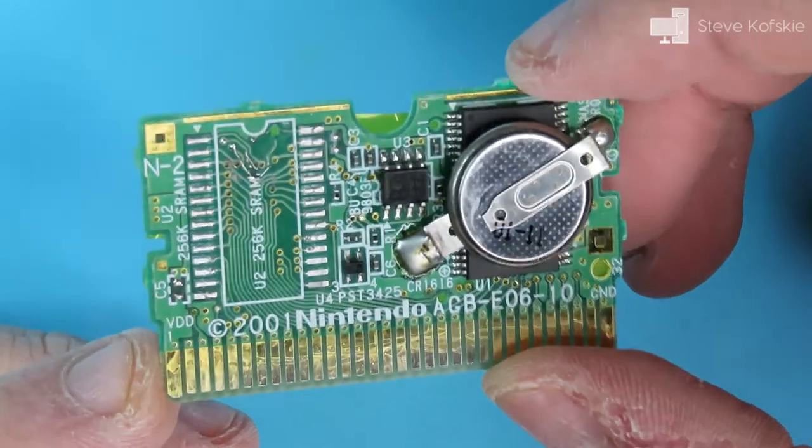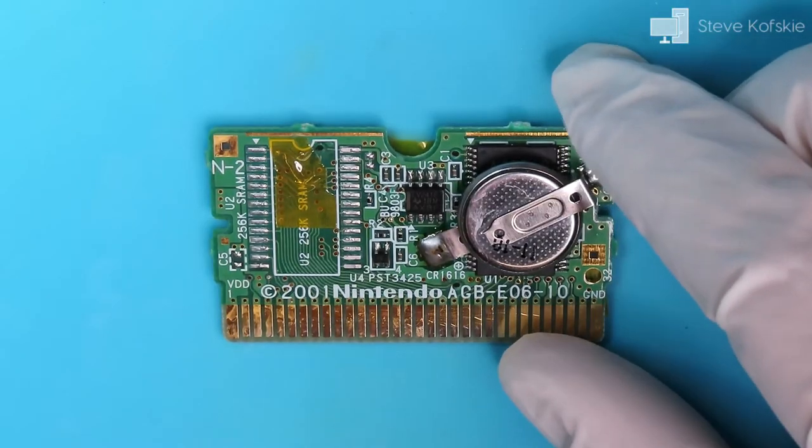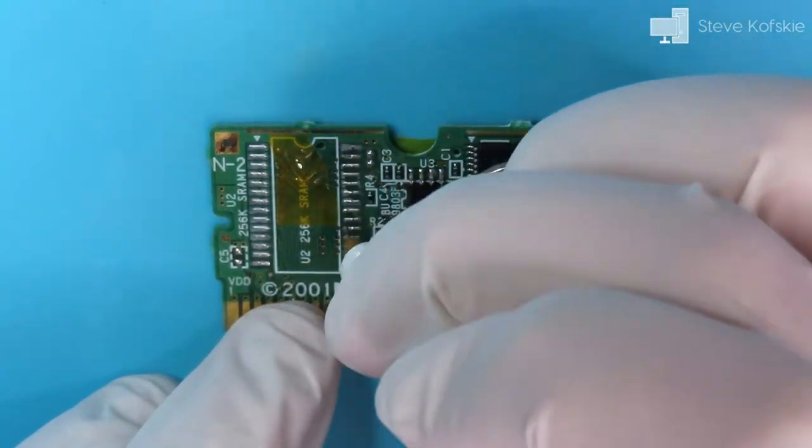When I finished those two up, I placed a small piece of Kapton tape over those two jumpers since I didn't want them to move when I reapplied the chip. Since that work was done, I applied some new solder to the pads that held the chip.